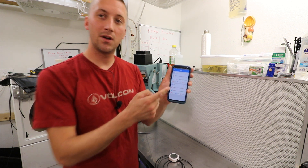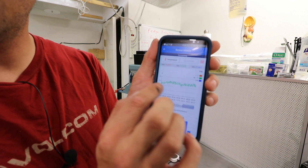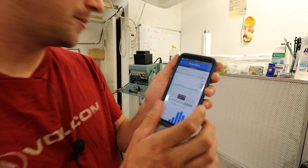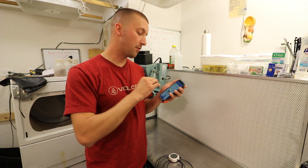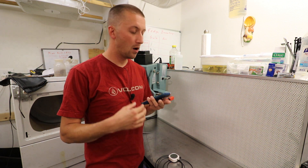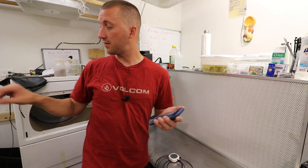You download the app and you can have both units there. When you open one up it shows a diagram of exactly how the temperature has been. This one is my incubation — it's pretty steady, just going on and off with the compressor. One thing you can see is when it gets too hot out, if your compressor just keeps going and the temperature rises, that lets you know your air conditioning compressor is not big enough.